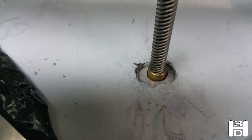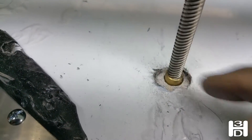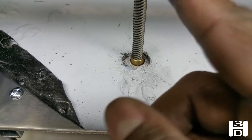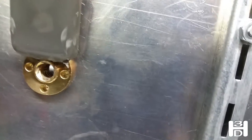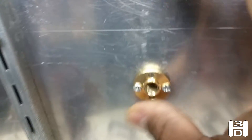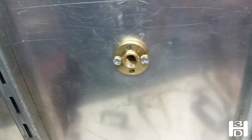When the nut is in, the threaded rod should sit pretty much centered in that hole. As you move the print bed up and down it should stay in the center — if it does, you've got it lined up just right. Once we have our TR8 nut set in the appropriate spot, use a punch to mark your holes, then drill those through. I'm going with just two screws, and two is fine, because all the pressure is coming from the top — the weight of the Z platform keeps this in place, and two screws with nuts on the other side prevent it from getting loose.